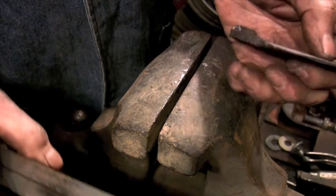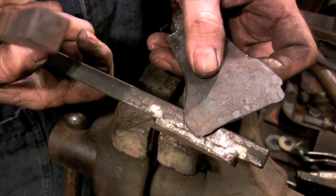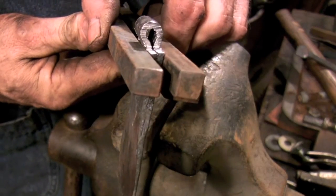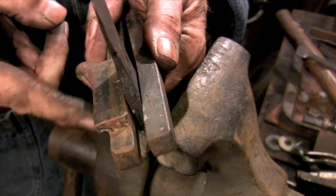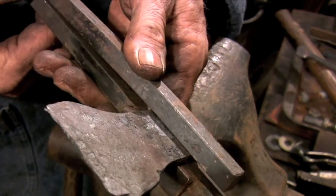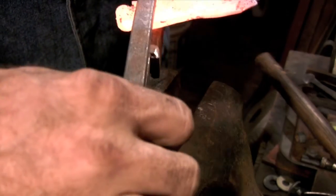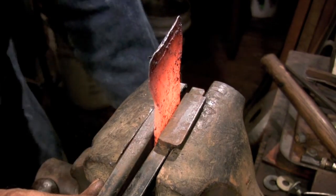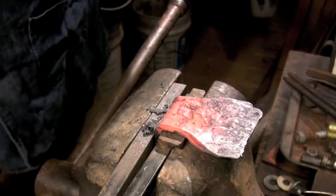The only specialized tool that you're going to need to make for this hinge is a vise insert that matches the thickness of the wood that you're using for the box. That thickness is measured from the inside edge of the barrel to the inside edge of the bend. For this hinge I'm using 3/4 inch lumber, so I've added a 1/4 inch piece to my vise insert, which was made with 1/2 inch bars. So this vise insert allows you to get the hinge set up very quickly in the vise without having to measure anything. Every single hinge is going to have exactly the same bend.